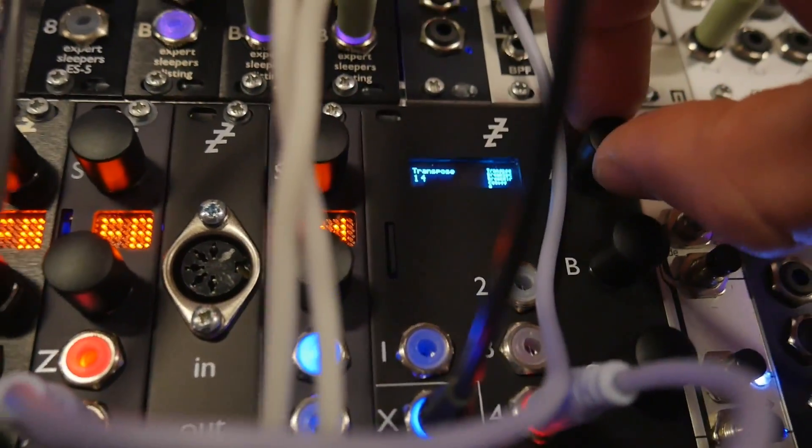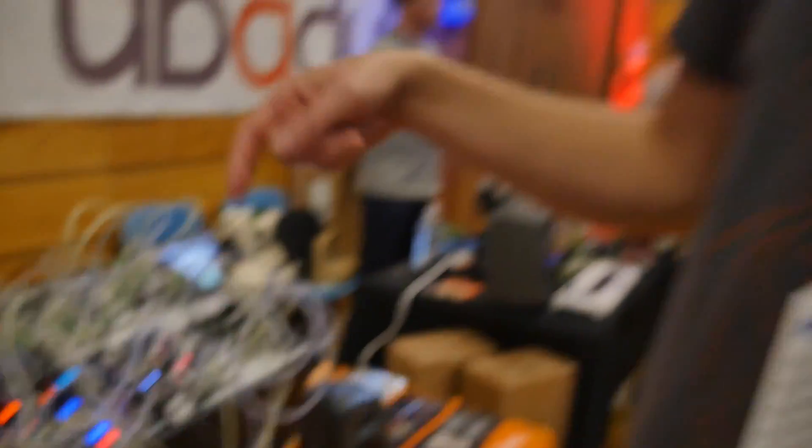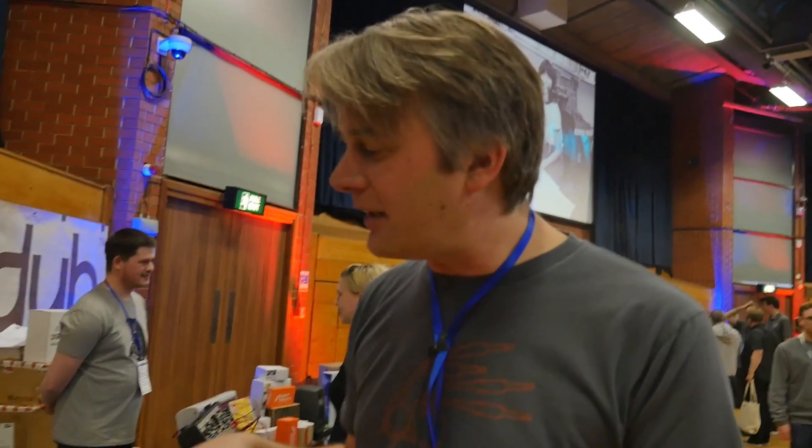So let's transpose that up a bit so we can hear it better. This particular mode's got a ton of parameters because you've got up to five layers of sounds. You can control the sounds, pitch, pan, attack, release and stuff. The chip is by a company called Dream — it's a little off-the-peg General MIDI chip. They intend it for things like answer phones. But if you actually study the General MIDI spec, it's not just play piano and bass and a drum track — there's a whole extra level of tweaking the sounds. You can make really quite interesting sounds, especially once you dirty it up a little bit. There's a lot of synthesis power in a very small space, and my job as the module designer is to bring that under CV control so that in a modular context you can access that power in useful ways.